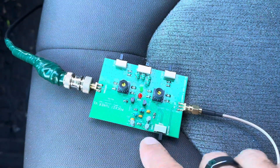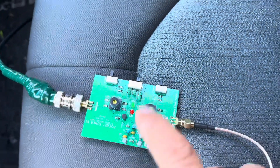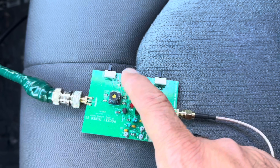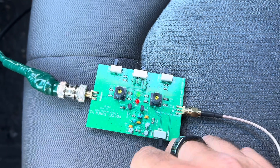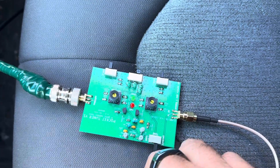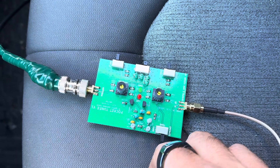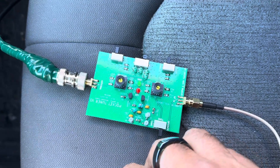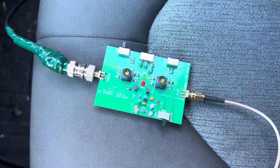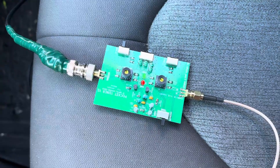This tuner has a tune and operate button like every manual tuner. This is the three-point inductor tuner selection switch. It selects between 0.5 microhenry, 1.5 microhenry, and 2.5 microhenry. It kind of tunes up to 40 meters but struggles at 80 meters.